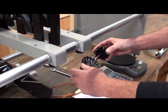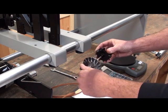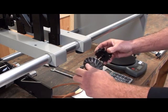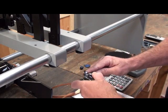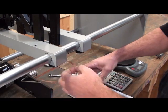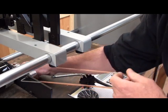We have already balanced the turbine shaft and we've already balanced the compressor assembly. Now we're going to do an assembly balance. We'll go ahead and tighten it — not torque it, but tighten it so it does not move. Now we'll install the part into the balancing machine.